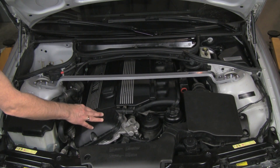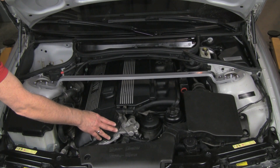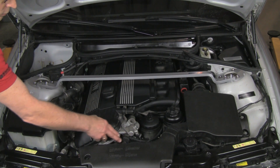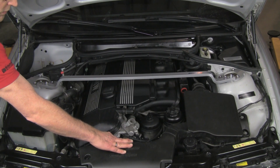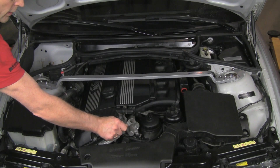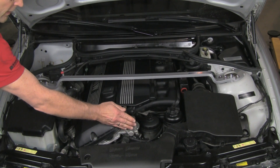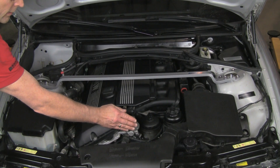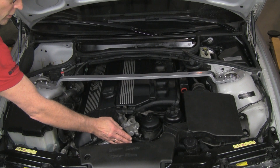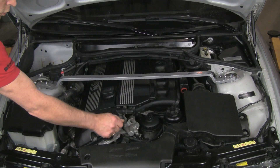On the other side, let's continue with our cooling system — we're going to check the water pump for bearing looseness. On this 330i with a manual transmission, there is no engine-driven cooling fan, only an electric fan behind the radiator. Normally, with an engine-driven fan, you'd grab the fan blades and wobble them forward and backward to check for play. If there's play, you check whether only the fan moves or whether the water pump pulley behind it also moves. If only the fan moves and the pulley doesn't, the clutch is bad. If the pulley moves with the fan, the water pump bearings are getting loose and a water pump replacement should be planned before it fails. No movement means everything's okay.